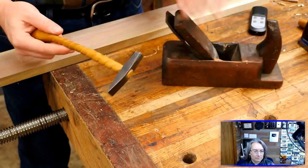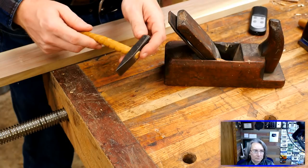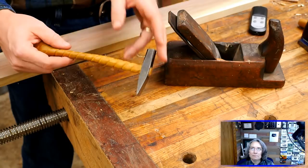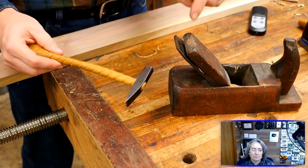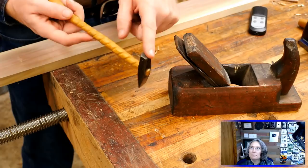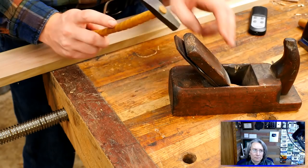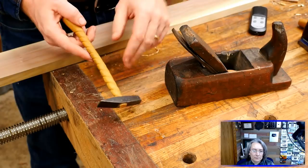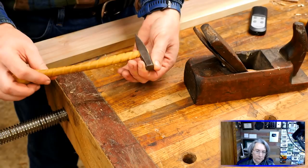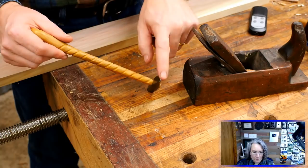About now people start objecting to using a metal hammer. This is a really lightweight hammer — historically it was very common to use a steel hammer on a steel iron, so it's not a big deal. You will start banging things up, as you can see this has been torn up because someone used a bigger hammer. This smaller head lets me focus on exactly where I'm hitting it on a flat spot without hurting the wood as much. Sometimes I'll use the side of the head so I'm not denting the wood with a small point — I can put just as much force into the plane that way. One of these days I'd like to make one with a brass head. This wedge shape on the back of the hammer is actually really useful if the wedge jams — you can use it to tap the wedge back out of the body.